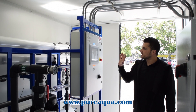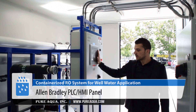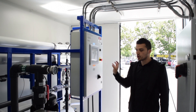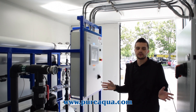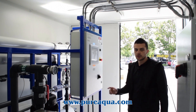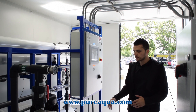We're utilizing an Allen Bradley Compact Logix PLC. The entire plant is controlled locally here and can also be centrally monitored within the end user's main PLC. We also have remote monitoring enabled, where the customer can monitor all parameters remotely and turn the system on and off as needed.